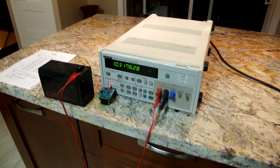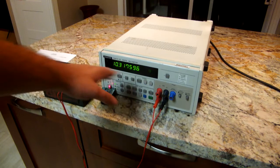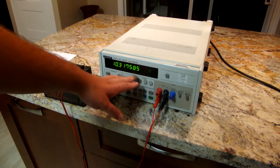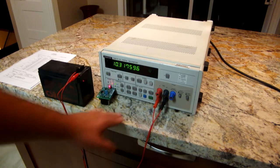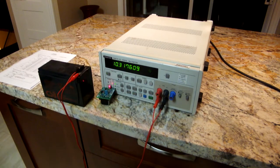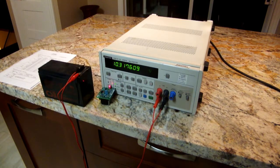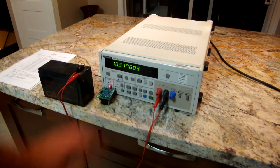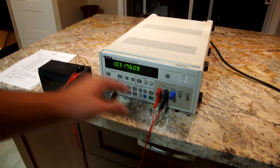That's kind of an interesting feature — I don't know that other meters do that. Some modern ones offer more accurate readings over GPIB, but I like that this one gives the full seven and a half digits on the display. If there's no improvement in accuracy for those last values, you can enable smoothing which averages up to 100 readings as a rolling average, basically improving display accuracy at the cost of update speed. You can probably pull another digit of accuracy out by using that averaging with a good stable signal.